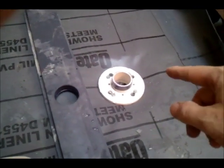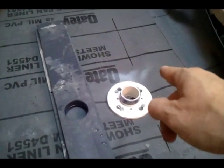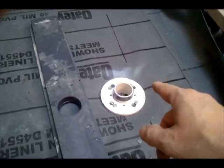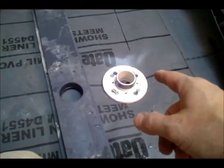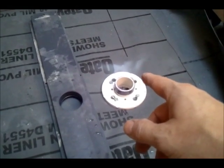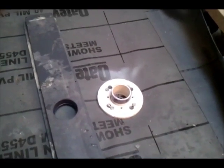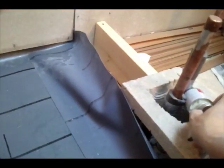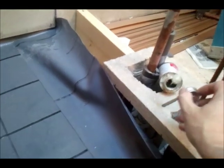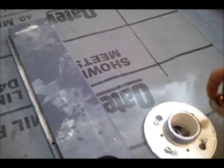Okay, I said purple primer, but I use the X15 rubber welding cement on the rubber, because that stuff is made to work with the rubber and PVC. It's a better binder, softens up the rubber and sticks to whatever touches it. Especially all these chemicals and PVCs, they're just made up. So I've got the glue over here, and anytime you do a slip joint repair, you want to be liberal with this stuff,